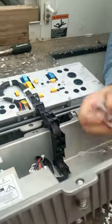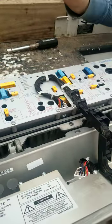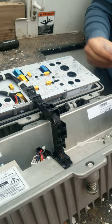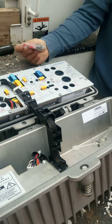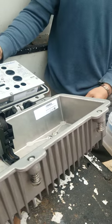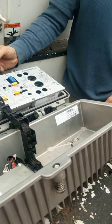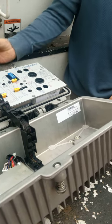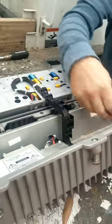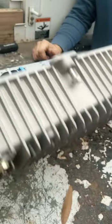Now we get somewhere. These are your shunts. One of these ports will have a shunt in it to power the amp up. If it has another shunt somewhere else, it's sending power further down the line, just like the node. Typically, the manufacturer got cute with it years ago, and they made the red one. The red one typically signifies your input power. But plenty of techs, like me, just shove a black one in there, but it's kind of obvious where the power is. If you have a question, just stick your tongue on it and see if it's hot.